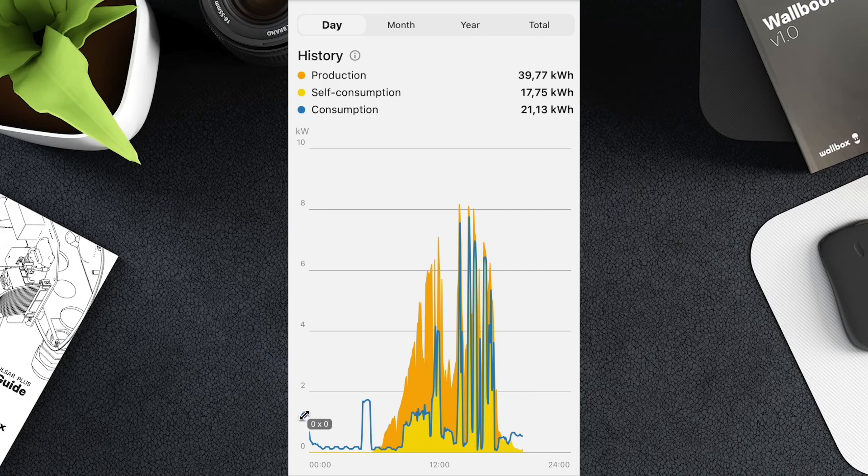One issue with three-phase installations compared to single-phase is the following. With 1.4kW as the minimum to charge at 6 amps in single phase, you have many opportunities to charge because even with a cloud you have enough energy. But in three phase, you need 4.2kW to start charging, so the available charging time is lower — the charger will switch on and off many times, which can eventually cause damage. So in climates with many clouds, I would suggest single-phase installation: you can charge anywhere from 1.4kW up to the maximum, covering a much wider range.